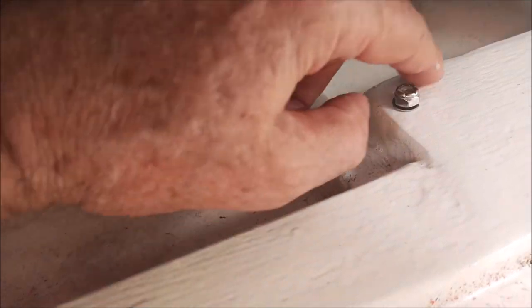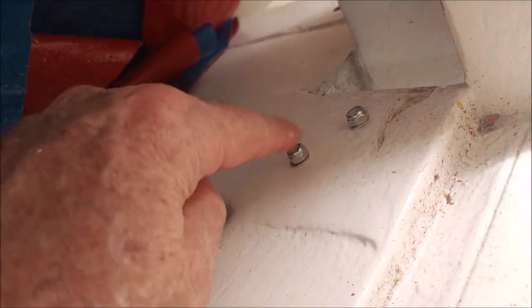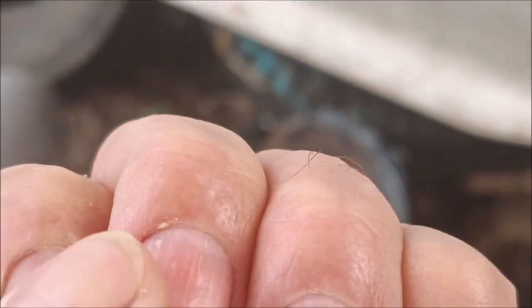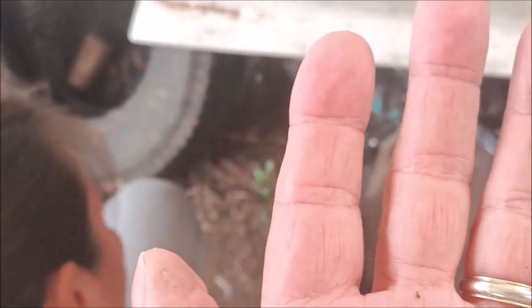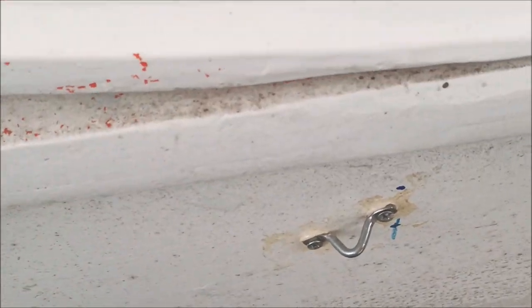One screw went through a thin part and one through a two-by-four, so you can't put the double hoop on there because it has to be flat — it doesn't work at an angle with one high and one low. Those don't get the little double hoop, but the one up front will get the double hoop — one on the inside, one on the outside. We're epoxying everything so water can't get into the center of the wood. If we seal the outside and the inside, water shouldn't penetrate and cause rot — that's why we're slathering on all this epoxy. If you get your finger wet you can smooth epoxy because epoxy doesn't stick to water well.